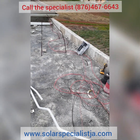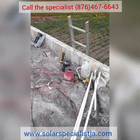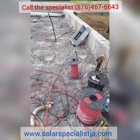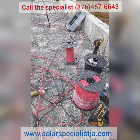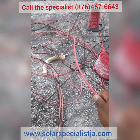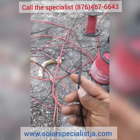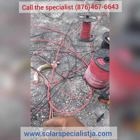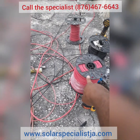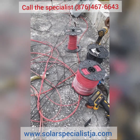As you can see, this wiring is extremely shabby. Not only is it shabby, but it is the wrong type of wire — wrong gauge, wrong everything. What we have here is 10mm wire and 2.5mm AC wire. So we're going to be replacing that with 10 AWG DC wire with the proper insulation to handle the heat coming from the sun.